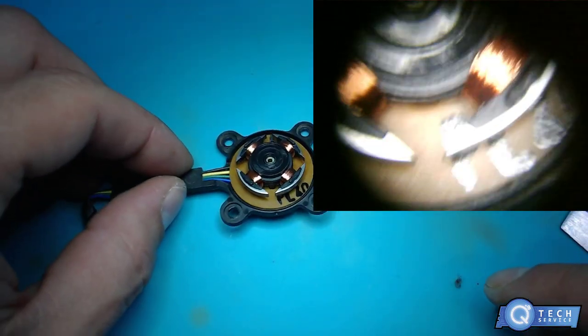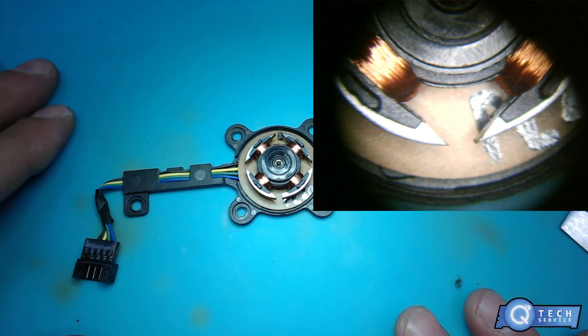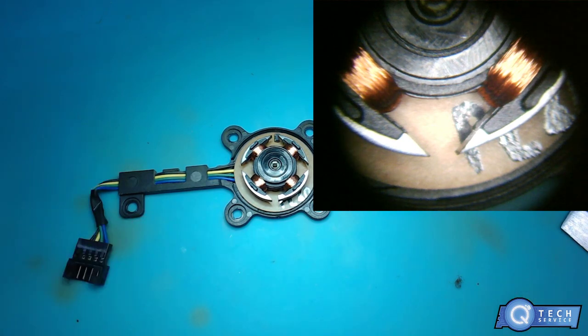Oh. Yeah. See, this is how it's supposed to come apart, Kyle. See this? Gotcha. See where I'm at? This is how it comes apart. Well, that fan was grinding, making noise. That was the bad fan. And it was grinding because it was broken. It wasn't really the grease so much. It was putting pressure on one side of the fan.